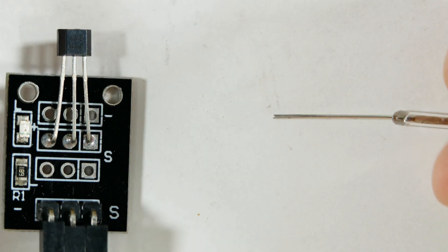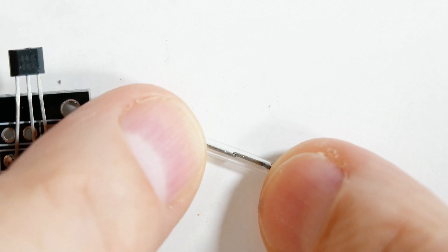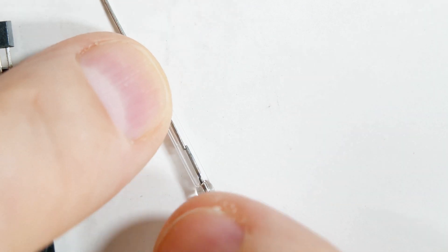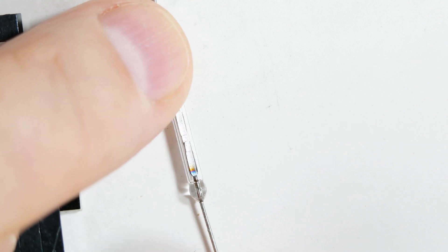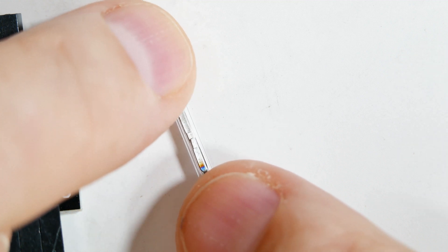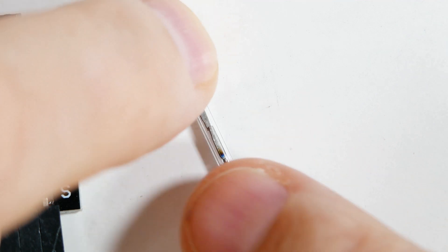There's a very, very tiny separation between the two contact points — and it's not showing up on camera. What I'm trying to say is that limits the amount of current you can put through here, because they will arc shut really easily. They're kind of fragile — the envelope is fragile, the contacts are fragile, they like to arc together, and they won't carry a lot of current.